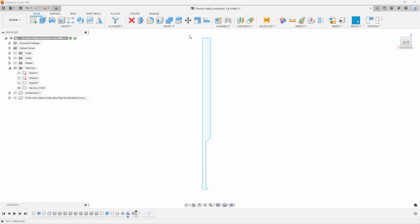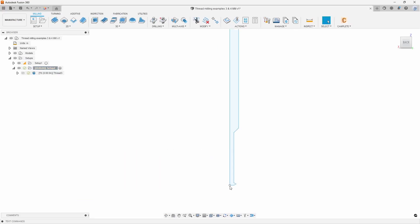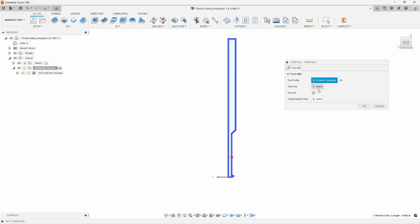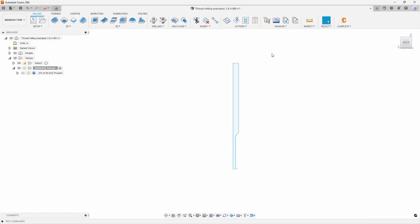Right here is the 2D sketch line of the side profile of our cutter. As you can see it's drawn with just half the axis — I haven't revolved it yet, but for what we're trying to do we don't actually need to revolve it. We're going to use Fusion's form tool option to create the tool just from this sketch line. So let's jump into our manufacturing section. Under Manage I can say Form Mill, then I can select the tool profile and the tool axis right here on the center, and my compensation point is going to be right here on the side of the tool furthest out. I'll hit OK. Now we won't actually see the tool being created, but we will see this in our tool library. So I'm going to go ahead and walk us through the entire setup for our part.